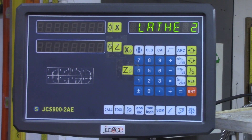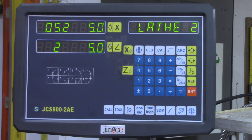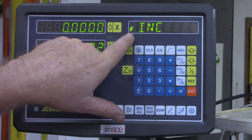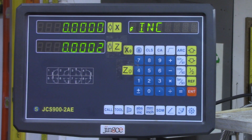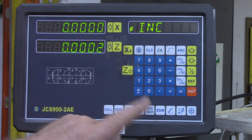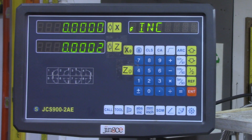Once you've got lathe two selected, press this S button over here. Now you see this little character right here? We didn't have that character before. To change between diameter and radius, now we use the half button. How these guys found this I don't know, because it's definitely not in the manual — the manual is very bad translated Chinese anyhow.